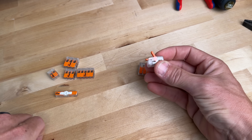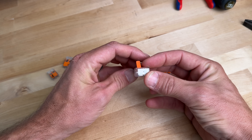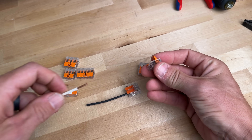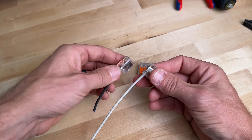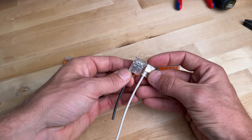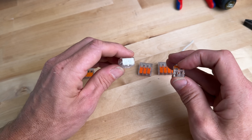Overall, the functionality is very similar. The wire loads to the side where the lever opens up — you press it in, open up the levers, and make sure you're getting your wire all the way through by looking through the transparent housing, then close it down for a secure connection. WAGOs are a little bit better in that you can see from the top side and also very clearly from the back side, whereas on these Harbor Freight ones the bus bar covers that up, so you can't clearly see that your copper is at full depth and properly seated.